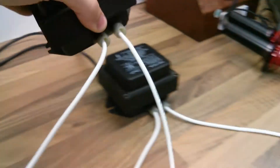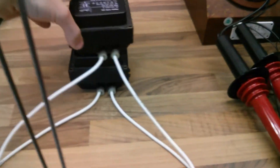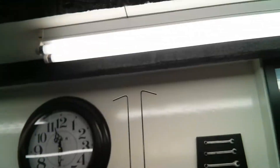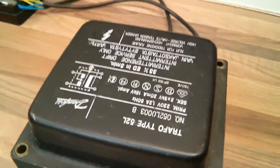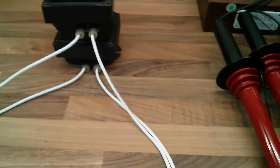The difference between the two would be the same in voltage. If I put that one on top and connect it up in this configuration, in most cases that configuration would work. We've got a Jacob's ladder here as an example of something you might want a bit more current for - you want to get right to the top and you don't want to make it narrow because it doesn't look as cool. So you decide on paralleling up two high voltage transformers to get twice as many milliamps - instead of 20 milliamps you get 40 milliamps - and keep the voltage the same.